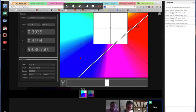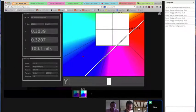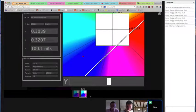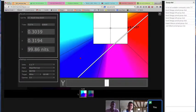And if I go to the next graphic, this is out of the box, RGB HDMI input with the same white field. So you can see that they really have got the RGB YUV color transposition exactly correct, because there is no difference between the color of the monitor with an RGB input and the color of the monitor with a YUV input. And that's traditionally been a problem, particularly, it has to be said, with JVC monitors and Panasonic DTV series monitors.